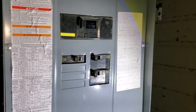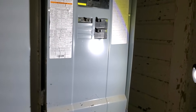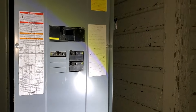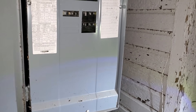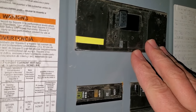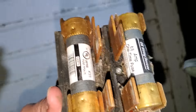You actually don't have 200 amps available. It's from my barn and my Quonset. As far as I can tell, you only have — maybe we could pull this cover off here and look just to be sure — but as far as I can tell, this 200 amp is just a means of disconnect. You obviously only have this amount of amperage available for your whole property.